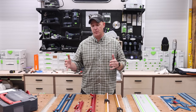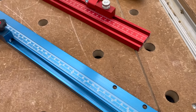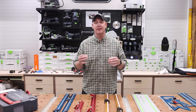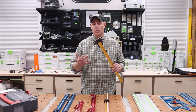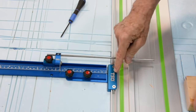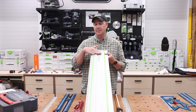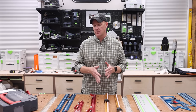Now let's get into some similarities between each of these. They are all constructed of aluminum in some way, shape, or form — some steel pieces, but mostly aluminum — with some sort of T-track design, a head, and some sort of stop system. They all have a narrow rip setup as well. The TSO and Woodpeckers operate off of a steel rod that slides underneath the track, and the Seneca has an attachment that goes under a channel and also underneath the track, allowing you to make thin rips. Each one also has a metric or imperial version.